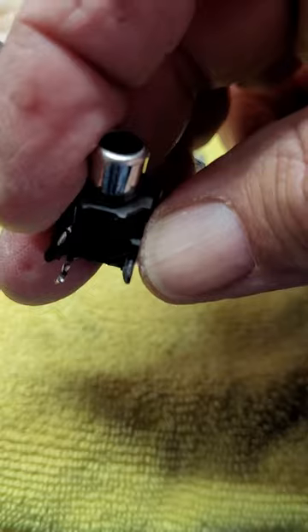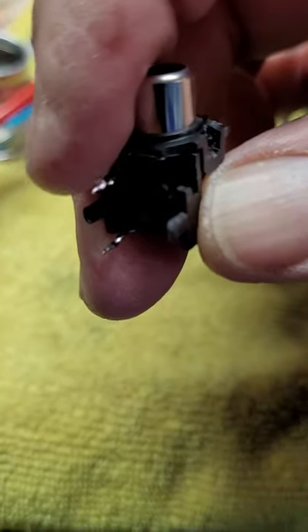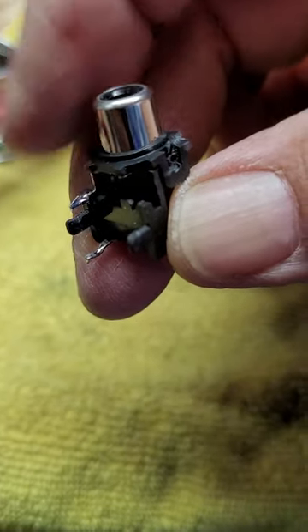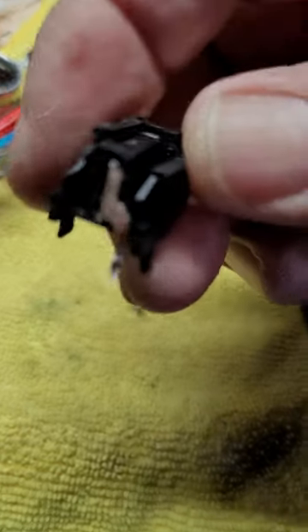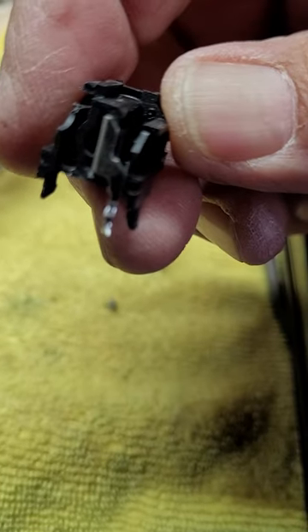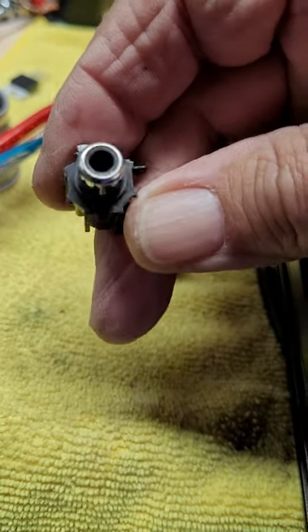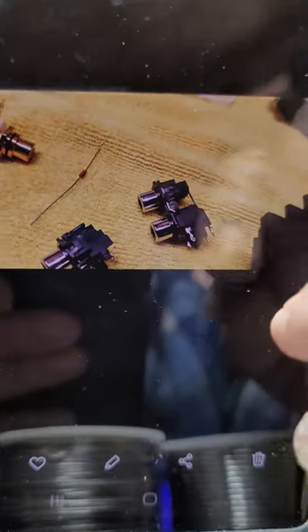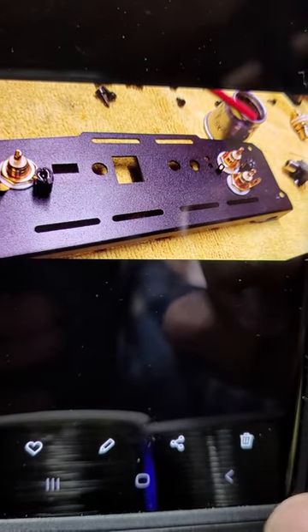Same deal - that was mounted like so on the board. The upper one is the ground, and you can test that with your volt meter, your continuity meter, ohm meter, whatever. The top one is ground, the bottom one is hot. And you see on the back side here, that strap is the hot - hot being the center of the RCA. The outside is the ground. That's where I pulled them out, and they're soldered.